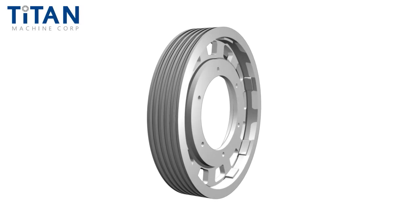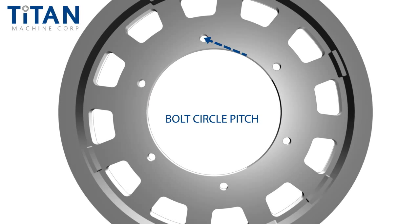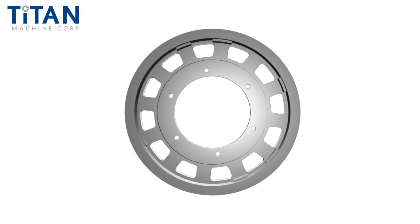Let's measure the bolt circle pitch. This is the distance from one fastening bolt hole center to the adjacent hole center. By providing this dimension, we can mathematically determine the bolt circle diameter. Next, count the number and size of the mounting bolts. If there are any push-off bolts, provide the same measurements and specifications as with the mounting bolts.